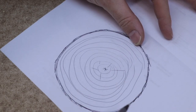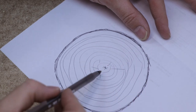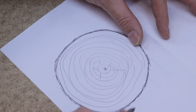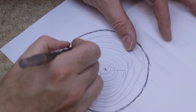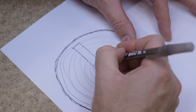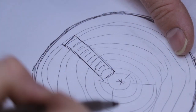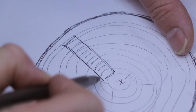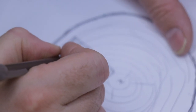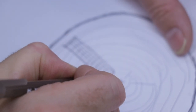If you're not familiar with the term quarter-sawn, let me show you using this diagram. This outer portion represents the bark of a tree, and this represents the center of the tree — you can see those annular growth rings. A piece of quarter-sawn wood means that the grain is going from top to bottom of the board. As you can see, those annular growth rings are facing top to bottom. For this project we're using very thin pieces of wood, so that board would be cut into very, very thin pieces — which has already been done before I received the material for the build.